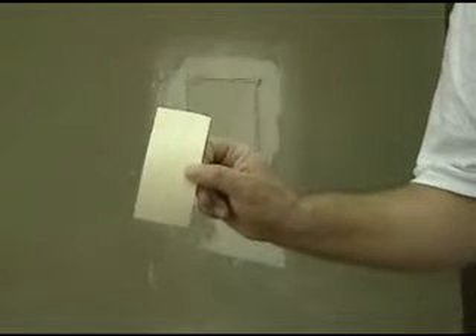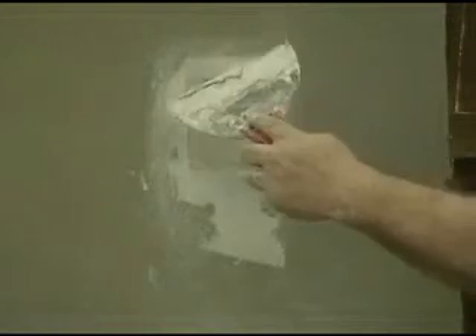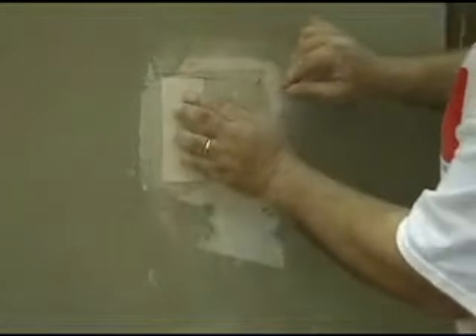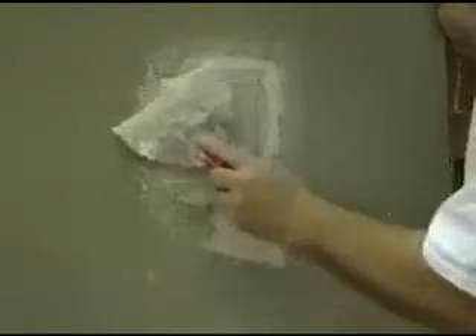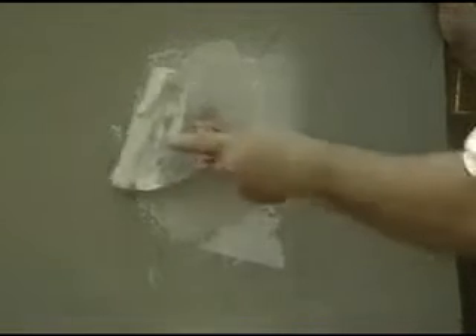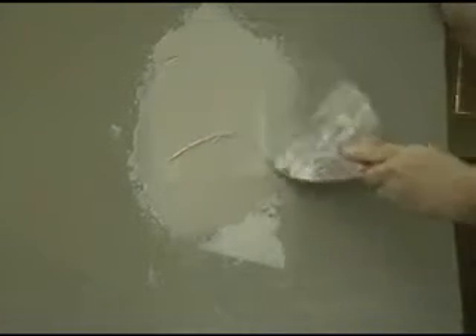We recommend using paper tape because the paper tape won't crack out the way mesh tape will. So now we're going to put about a sixteenth of an inch coat of drywall mud and put our tape right over that seam. Press it in a little bit, get the air bubbles out, then put a little over the top of that and wipe it clean. You'll do that to all four sides. Now we'll cover them up and work that in. I'm going to float this out just a little bit past the edges — it's going to make it look flush with the rest of the wall. Sand the edges down so it's nice and smooth.